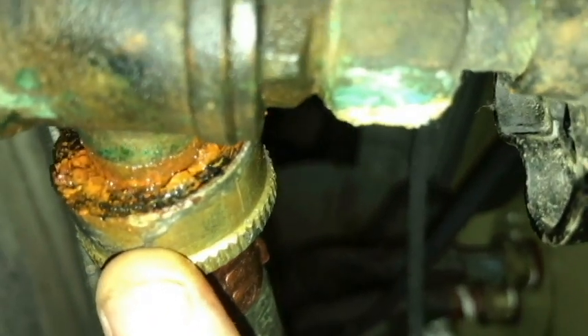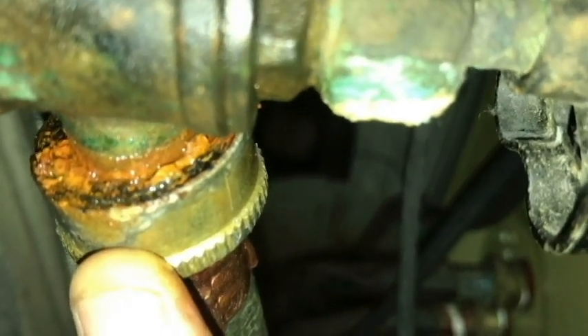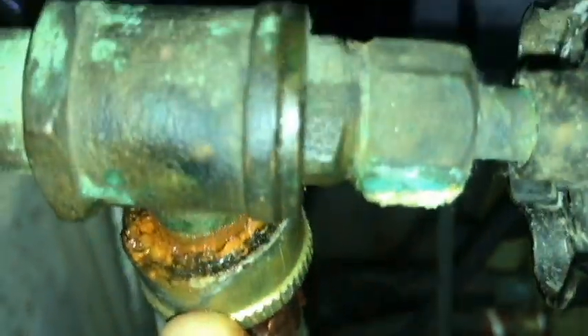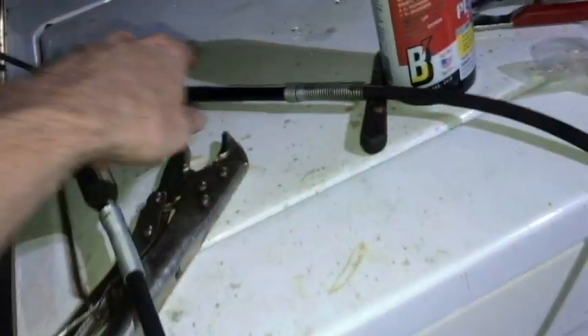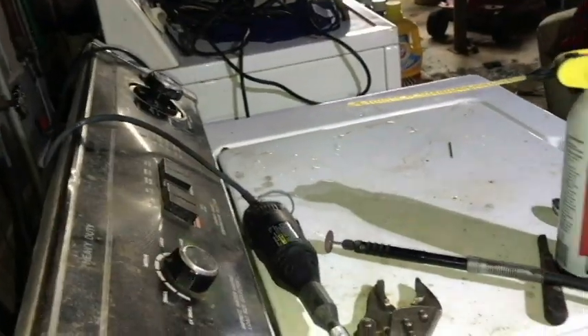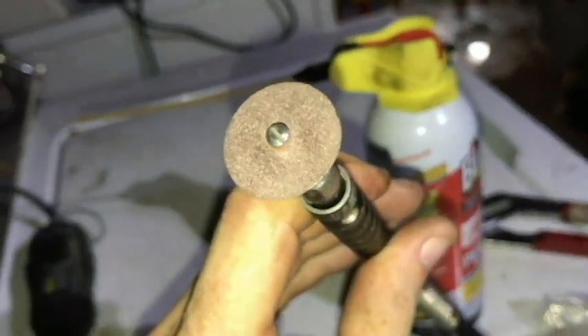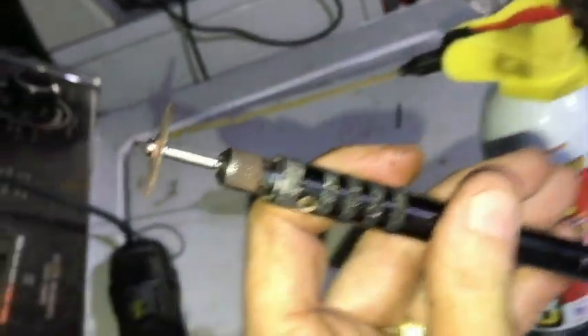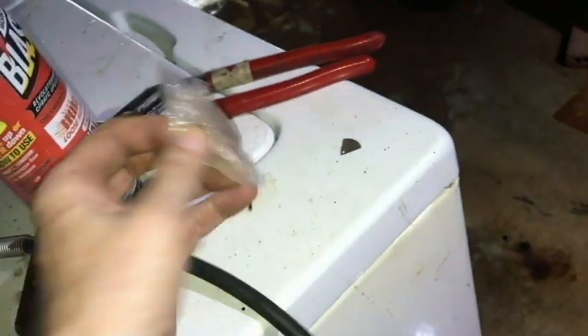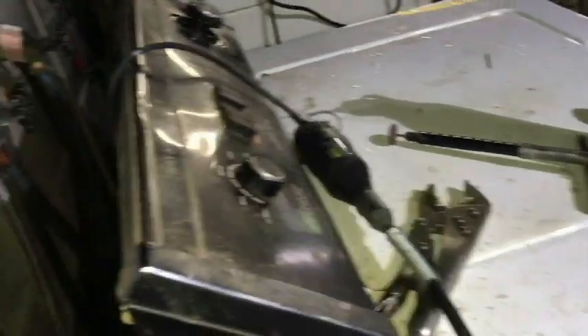So we're going to have to remove this. I can't get it off with my channel locks or even a vice grip. You can see that's 25, 30, 35 years of rust buildup. So we are going to use this Dremel. I've never done this job before — I'm not a plumber — but that's the go-to for me right now. I'm using a sort of aluminum oxide cutoff disc. I've got two or three of them because I'm probably going to go through them. I'm going to get a mask because it definitely stinks, and of course my eye protection.